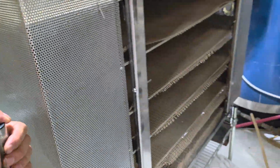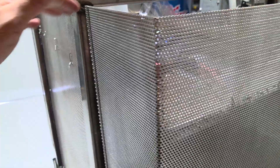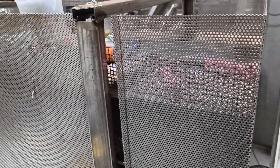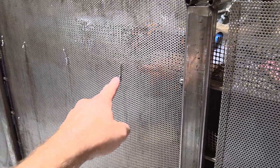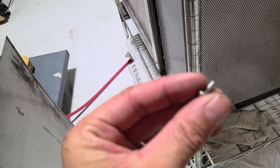Today we've been safety-wiring the cage on, which works, but they always break over time because of the tension load from the bags inside. We're upgrading by actually drilling and tapping out the aluminum and putting little fasteners in here to hold the cage on.